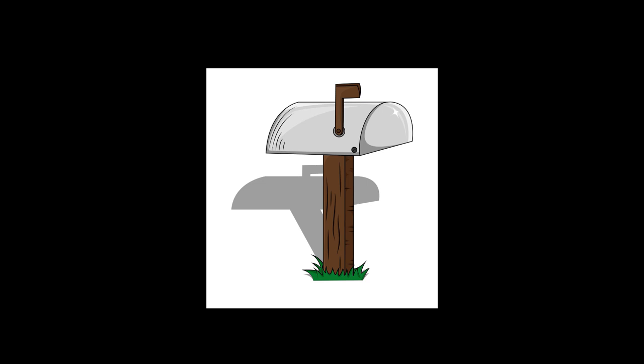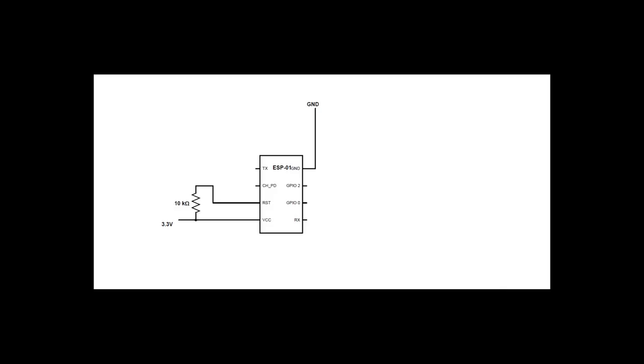So we need to add a bit of circuitry to make sure the ESP does not shut down until the notification is sent, although the door might be closed. This is almost the same schematic that was posted in the forum post, so please see the link in the description as well. First, connect ground of the ESP to ground, then connect VCC to 3.3 volts and pull the reset pin high with a 10K resistor to avoid accidental reboots.